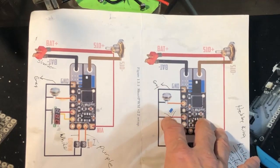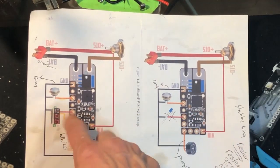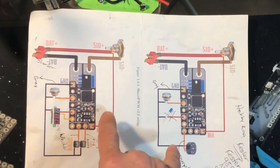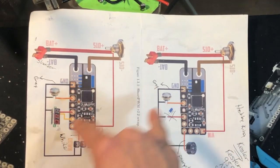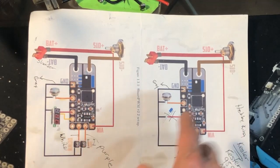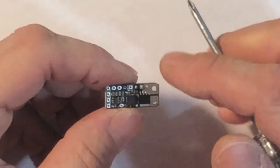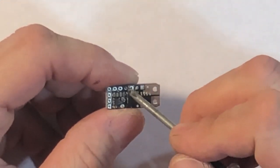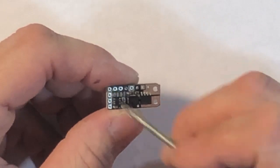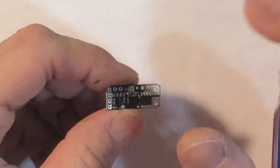You can have an LED diode as an indicator switch, or you can have a voltmeter. You can have the pot, or you can have the tactiles. You can switch back and forth. It's up to the builder and up to the user what they want. Remember, whatever you're hooking up, you're going to need a ground, whether it be the fire switch, the voltmeter, the potentiometer, or the tactiles. Now, there's many different ways to do this.